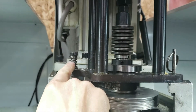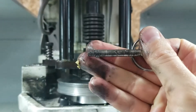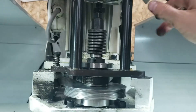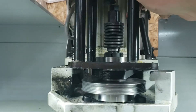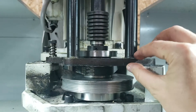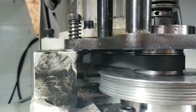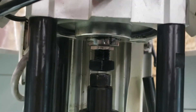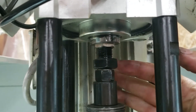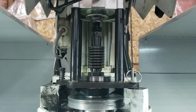There are two pins that hold this assembly in place: a ball-detented pull pin and a spring-loaded shoulder bolt. You can actually move the whole power drawbar assembly around. What I'm going to do is put washers under these two feet so the whole plate sits a little bit higher — that opens the gap up top, and by spinning this bolt I can close that gap even more. We've tightened this whole package to have better compression, and the benefit, hopefully, is smoother tool changes. Let me give this a try.